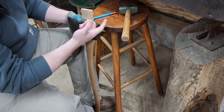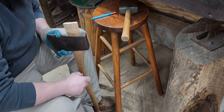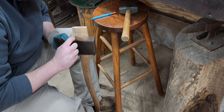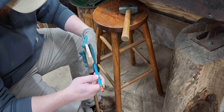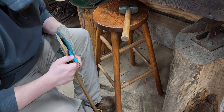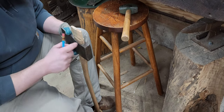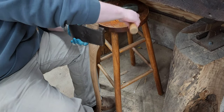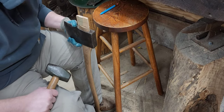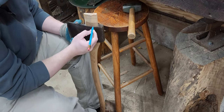We've still got three-quarters of an inch, maybe a little more to go. We are getting good compression almost all the way around in the eye. There's a little bit on the back corner here that still hasn't filled out, but the top side of this eye wasn't perfectly chamfered either, so that might be just a little bit of a gap. Keep driving it, see if I can get any more of that room to close up. Feels like I've kind of stopped making progress.